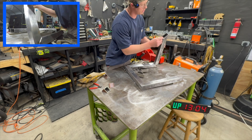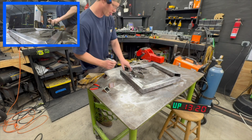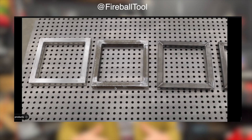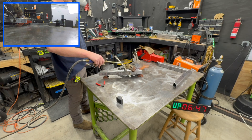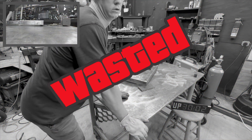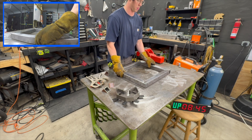The challenge that exposed everything - I recently tried the Fireball Tool Challenge. The goal was simple: weld two square frames under 30 minutes - flat, square, clean. Easy enough, right? I didn't even get to the welding part. I burned the entire 30 minutes just trying to set up my corners and get everything to dimension. Because on a wavy table, you chase flat like it owes you rent.